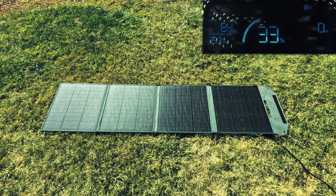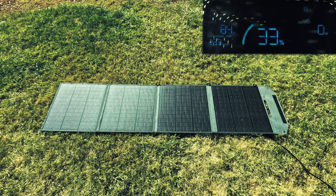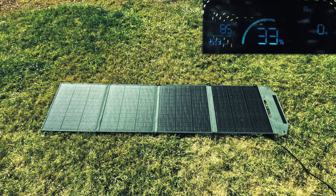Now let's charge our extra battery with the solar panels. The DBS 3000B supports charging directly through solar panels at a maximum rate of 600 watts, meaning we do not have to be attached to the power station for solar charging. Here we have it connected to our 200 watt solar panel. If we wanted to take full advantage of standalone charging, we could connect two additional 200 watt panels for a total of 600 watts, all connected to the DBS 3000B through the MC4 cable.